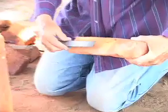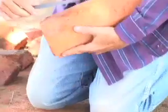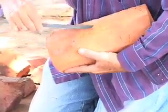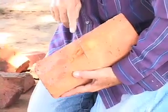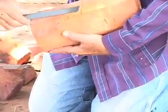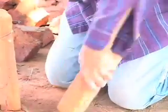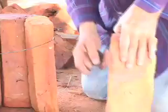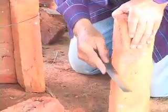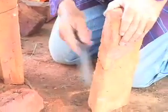If we take and we guess about where the middle is — let's say we're guessing it's here — and then we turn this around and we're guessing it's here, same distance, in the middle of those two marks is where the middle actually is. So that's the middle. We're going to cut this notch about 10 millimeters deep — you've got to be careful not to flip the brick.